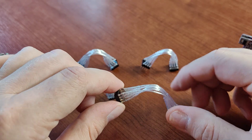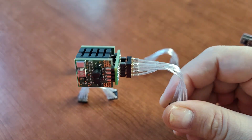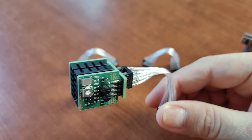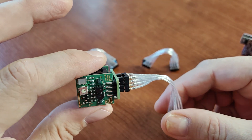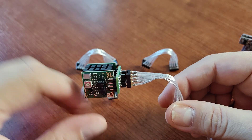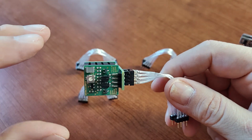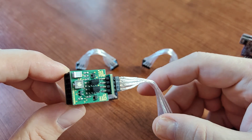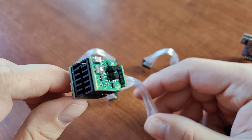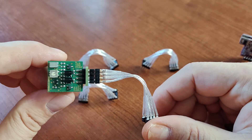The second thing is that if you place something like Staccato here — Staccato and other discrete Class A operational amplifiers will get warm. So you'll want to make sure your operational amplifier will not hit the board below, because it may short something. On the other hand, you wouldn't want to place it in a plastic bag, which might be the first idea to prevent shorting, because of the heat that this type of discrete amplifier will generate.